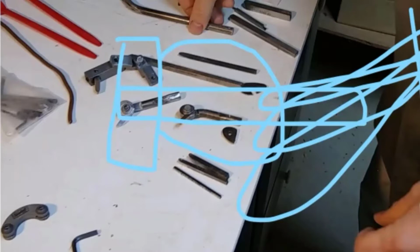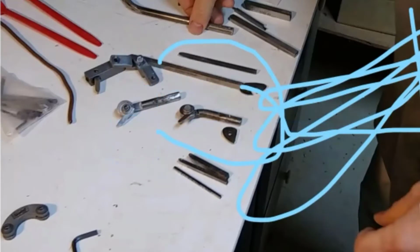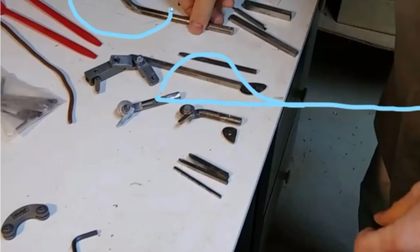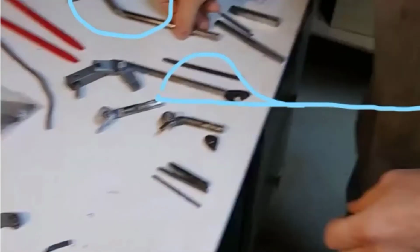And that's why you use these swan neck bars. The swan neck looks like this, and then it curves. Let me clear off this stuff first. A swan neck bar, if this is a straight bar, comes out like this, and then it comes back so that the cutting tip is roughly on the same axis as your main bar. This allows you to get around the corner without increasing torque. You'll see an example here that would be very low torque. But the Jameson system, where he just swivels the tip over without adding the gooseneck, is a little bit more prone to vibration, in my opinion. That's why it's better to use a swan neck.